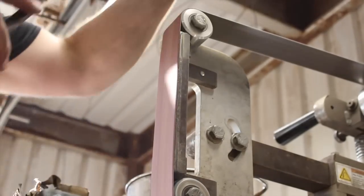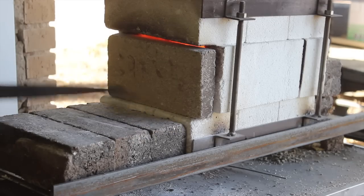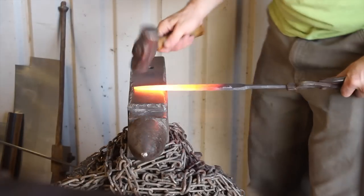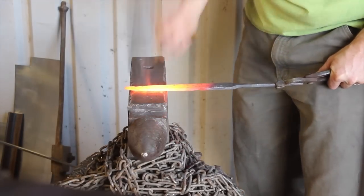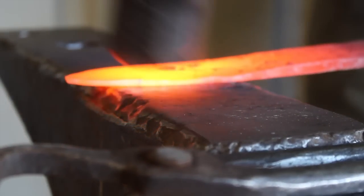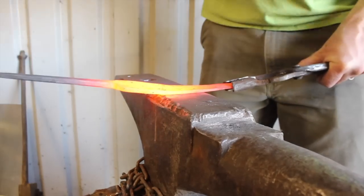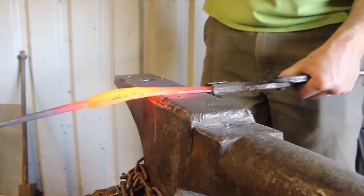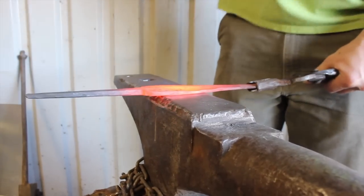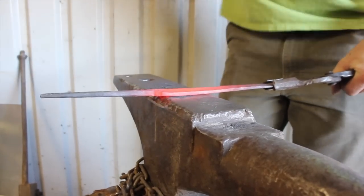Keeping the weld line away from the very tip is the best case scenario. If you were to stick this blade into something and twist it, that could put undue pressure on the forge weld if it was right at the very tip. I did a profile forging on the blade and thought I was done, then realized it was still really thick — about 5/16 probably. I decided I want a wider blade because this is still a little bit narrow for the accepted design of an Arkansas toothpick.